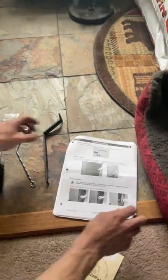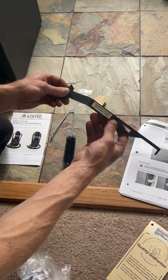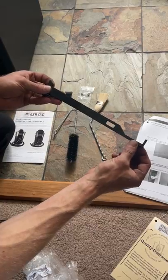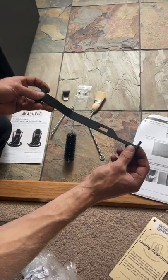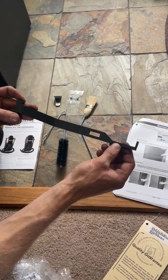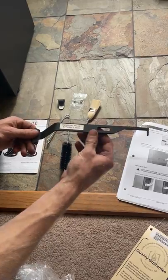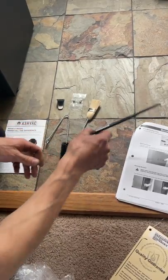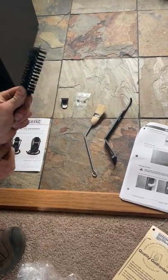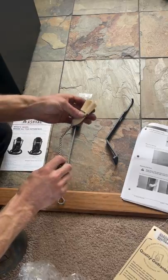Moving on from the manual, I've got a few different tools here. This is kind of like our universal pellet appliance tool — it does a lot of different things. It's got a scraper on here for cleaning the burn platform, and a little L-shaped end which you can also use for cleaning the burn platform — there are little holes in there and you can stick that in. This is also used for your heat exchange tubes for pulling the cleaning scraper in and out. It also has a little cutout to hang this on the back of the stove, which I'll show you in just a moment. It also gives you a couple of different styles of brushes — a bottle brush and another little generic bristle brush.